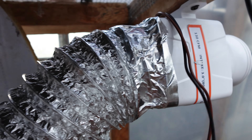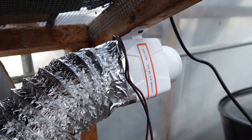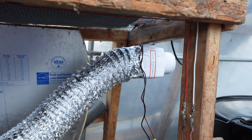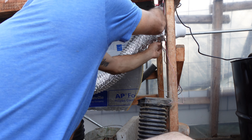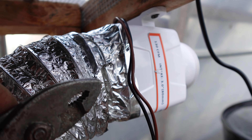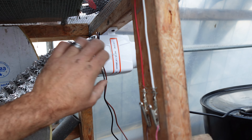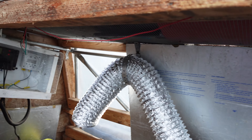We were able to get our tape on there. We've got a nice good seal, and that's why I really like this tape — it's form-fitting and holds its shape. It's got a little more continuity than just regular duct tape. And I've recycled it; when you buy the nice aluminum tape, you can use it over and over. Simply taking a small piece of wire and wrapping it around, I cut off the tag ends. I'm going to take a pair of pliers and twist it to really tighten that thing down and form a good seal. We've got a very nice solid seal on there — I can tug on it and you can see it moving on the mount. Now we just got to route this to our stove.